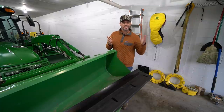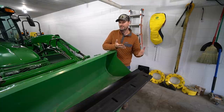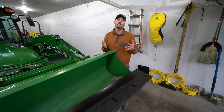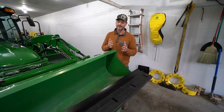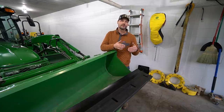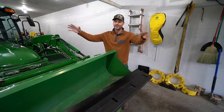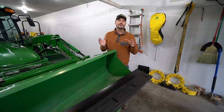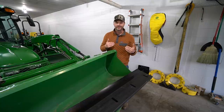So which edge do you think is going to scrape through and cut through that hard pack snow, ice — that material that's really packed down and been driven over? It makes sense that if something is very protective of a driveway, it's probably not going to do well at cutting through hard pack. The steel is going to be the absolute best at doing that, but right behind it is the UHMW — it's very good at cutting through packed snow and ice, just chiseling right through it. The rubber is going to be quite a ways back on that list. If you've driven over your snow a few times and you plow now, you're going to be able to get most of the snow out, but you'll see those tracks in your drive with a rubber edge because it's just not designed to cut through that.